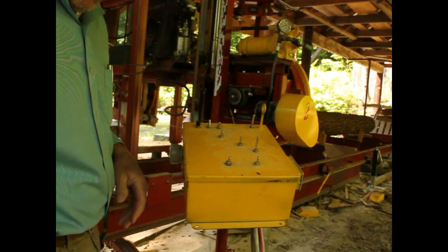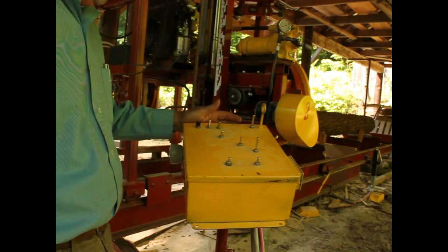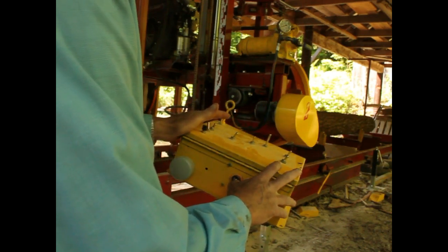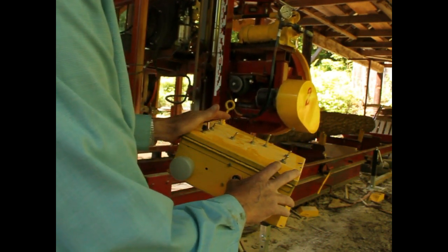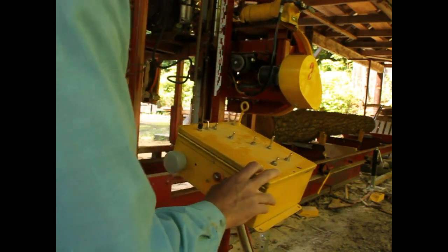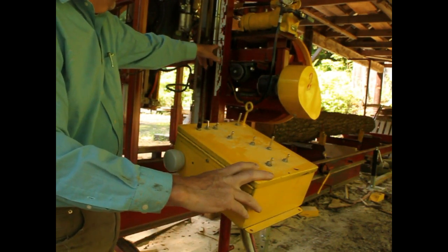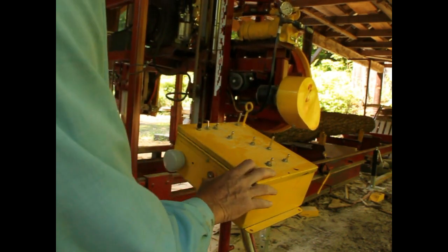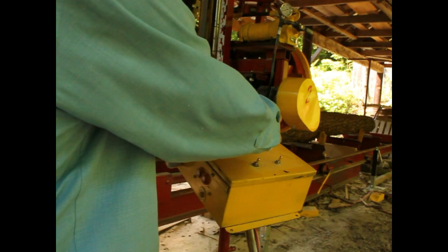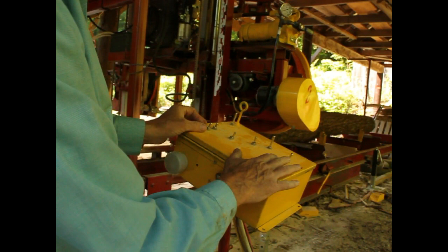We'll do a quick review of the controls, because once the engine starts, probably won't be a lot of talking that works for us much. So on the side is up and down. This controls the hydraulic pistons. I'm going to take it up. Or down. I don't know if you can see it, but the storyboard, the pointer is going by as we go up and down to tell you exactly where you're at. And then for drive, the drive is controlled here. There's forward, reverse, and speed.